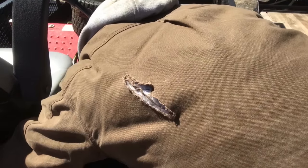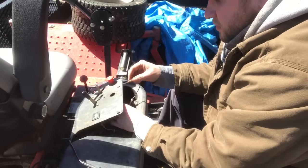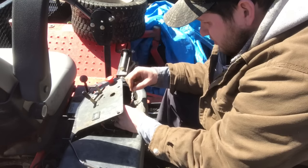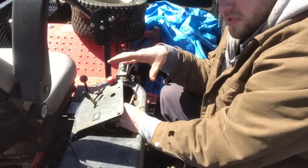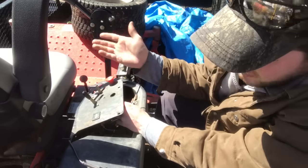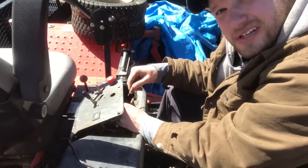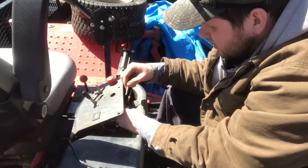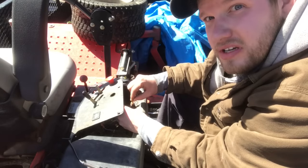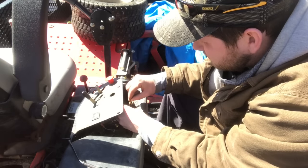What we need to do is fuel the fuel solenoid. There are a couple other controls and a bunch of ground switches — that's why I had to sit on the seat. I couldn't really find the wiring that went to the seat; it's just a little either ground-side switch or power-side switch for safety. I'll just jump these, and you can hear all those little relays clicking — that says we're good to go.